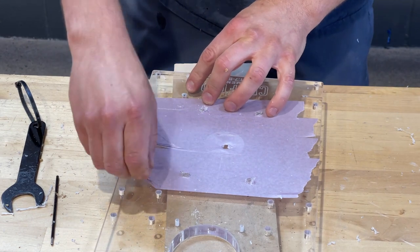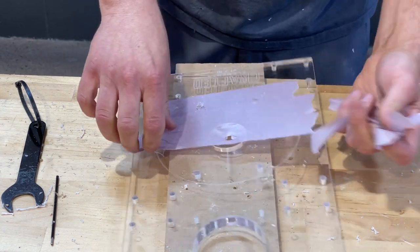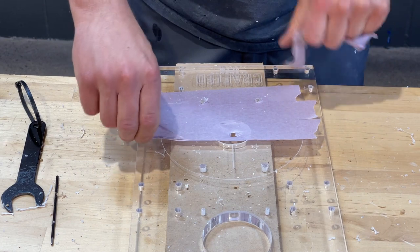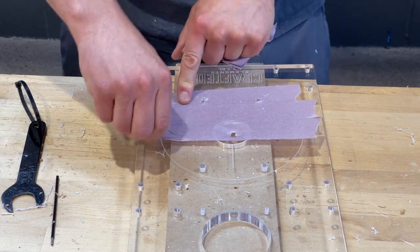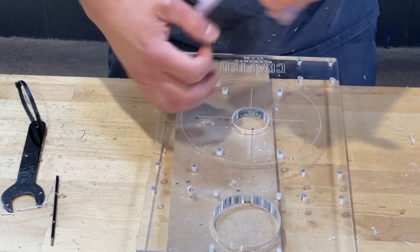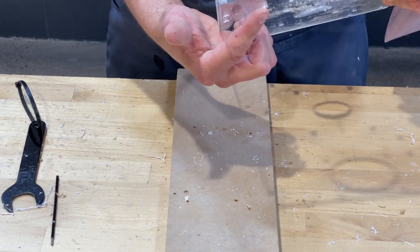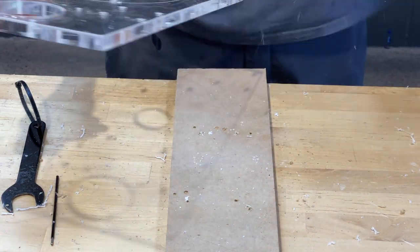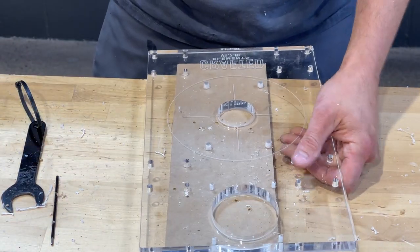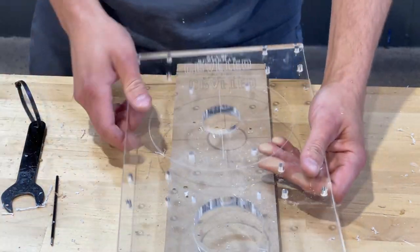Before you get your countersink bit out, remember that your screws go in from the underside, so you do not want to countersink the top — countersink the bottom if needed. Do you have to countersink? No. If your screws are long enough it doesn't matter if they protrude past the surface slightly, because the router bearing screws also protrude past the surface. I'd really only countersink if the screws aren't long enough to get through the material into the router. But I'll go ahead and show you what that looks like.